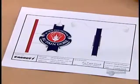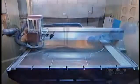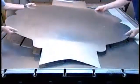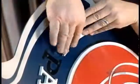They'll create this sign in various thicknesses of aluminum. The same computer-guided router does the cutting, but now they have to continually douse its blade with coolant to prevent the friction-generated heat from melting the metal. They coat the components with metal primer before applying polyurethane paint.